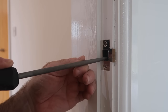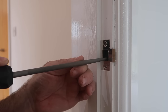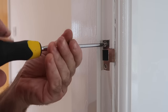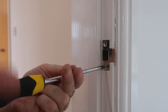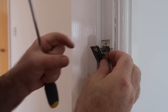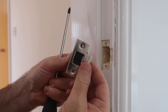If it's only just missing the hole, one solution is to grind down the bottom of the plate slightly with a file or Dremel to essentially make the hole bigger — though this only works if the latch is really close to fitting. In my case, the strike plate only needs to be moved forward a millimetre or two — a sixteenth of an inch — to get a nice secure fit. And what I'm about to do is exactly the same process if the plate needs to be moved down. Interestingly, my strike plate has its own plastic box which sits behind it, meaning you physically can't see any timber frame through the hole — the first time I've come across this type, and quite a nice detail.